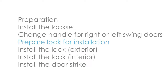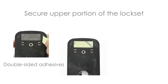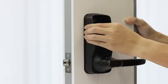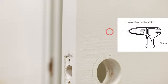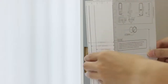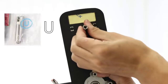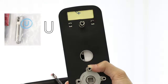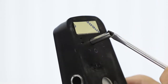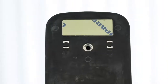Prepare lock for installation. The upper portion of the lock set can be secured with double-sided adhesive tape and optional fasteners. If you wish to have added stability, a drill is required if there are no holes prepared for lock installation. Please refer to the provided template for the drilling dimensions. After the hole is drilled, install the slotted barrel extension to the exterior assembly and securely tighten with a flathead screwdriver. If you don't want to drill a hole, double-sided adhesive tape is provided to help stabilize the lock during installation.